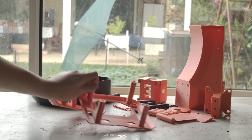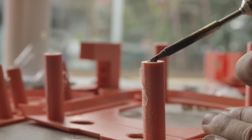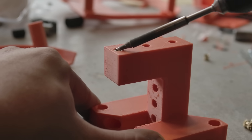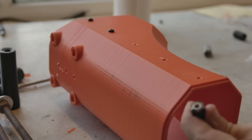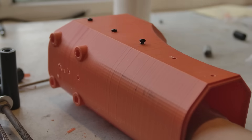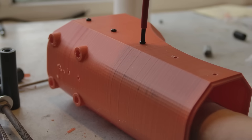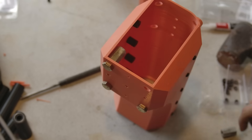This begins, as always, with some printed parts. Into the covers and spine pieces, I install a total of 10 threaded inserts. I put M4 nuts into 10 covers, then install these into the column. This is me experimenting with ways to install threads into concrete forms. Following this, we can install four M8 coupling nuts into the face of the column.